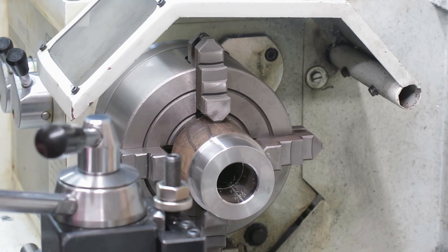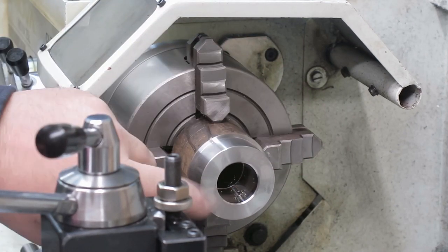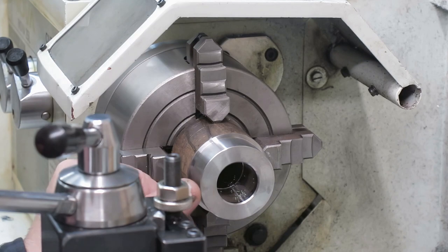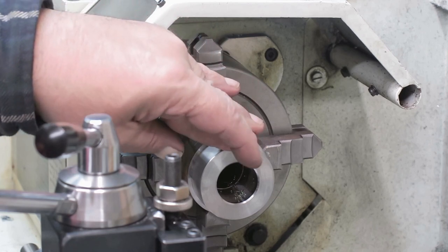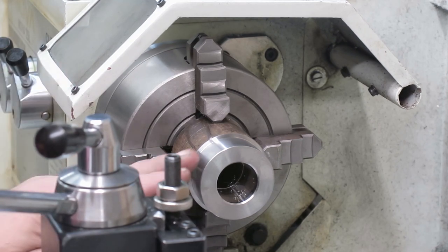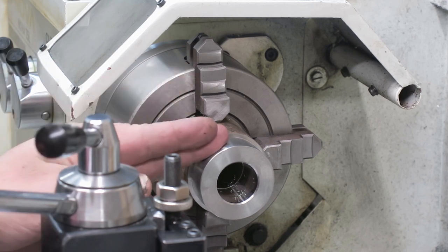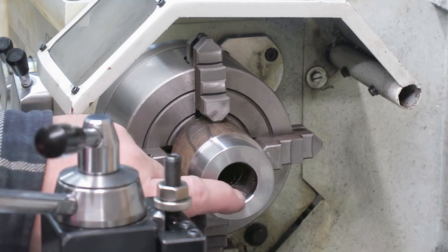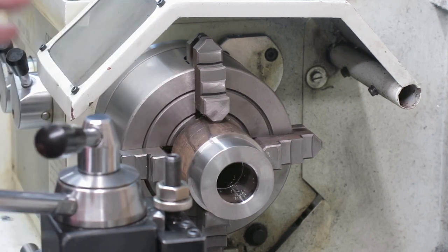So, what I have done here now is that this is now 51 millimeters in diameter. And I made a 45 degree chamfer here for the thread, and then I cleaned up this edge with the file. This edge will be visible only on the very edges of the nut. But it's still a good idea to do it now. And now what I will do next, I will turn it around, dial it, and then immediately part it. And then face, and do the same operations on the other side, I mean this chamfer here, and handle this edge. And after that, I will make the threads.